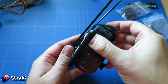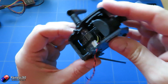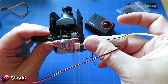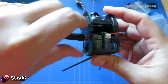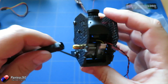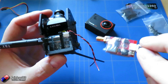There's an action camera on the top — let's just take that off because it's kind of in the way at the moment; we'll be reviewing that in a later video. The other thing we've got in here is the FPV transmitter. It's a very similar size to the one that came with the kit, and I've managed to mount it across the piece so the FPV aerial comes outside. Using a little needle file, I've opened the circular hole at the side, put a couple of corners in so it fits, and that fits beautifully. I'll put a link in the description if you want to order this one.